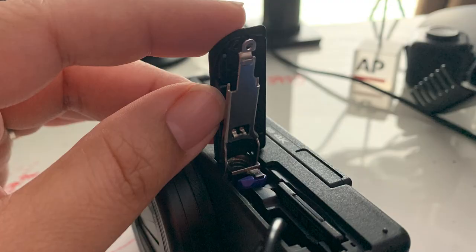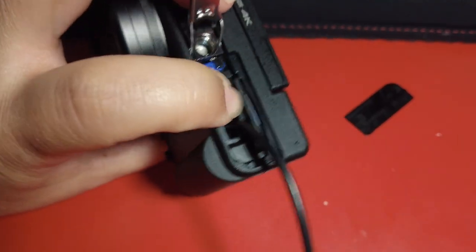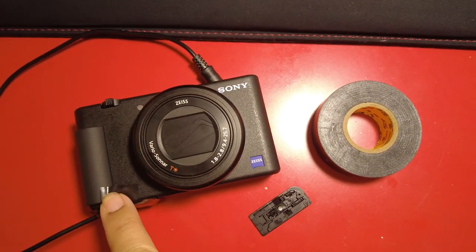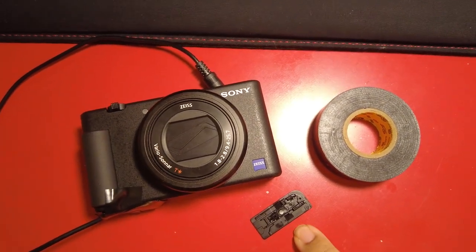Proceed at your own risk. Until a little earlier today, there was a very small screw here which kept this metal piece attached to the rest of the battery cover. I got a very small screwdriver, removed that screw, popped this open — now I have enough space for a dummy battery. I'm going to cover this with some electrical tape.